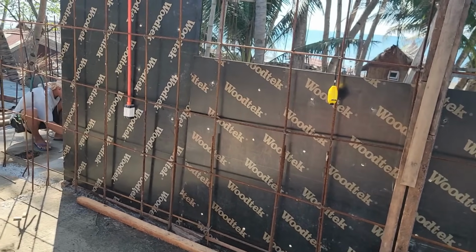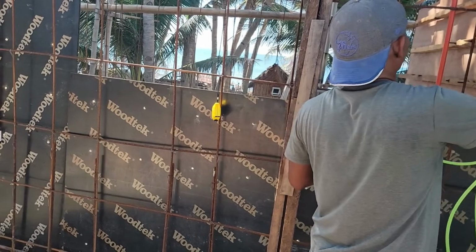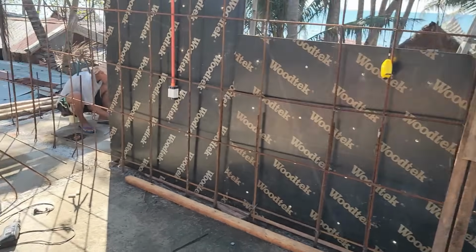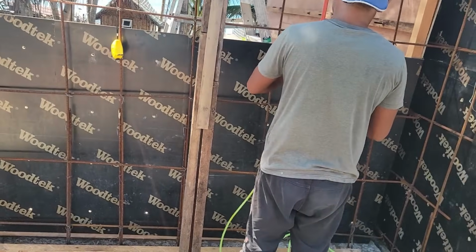You're just butchering up plywood in massive ways, with additional seams that are hard to get even. You really want to think that out when you're drawing your plans, keeping those rooms symmetrical to the lengths of the product you're going to be buying.